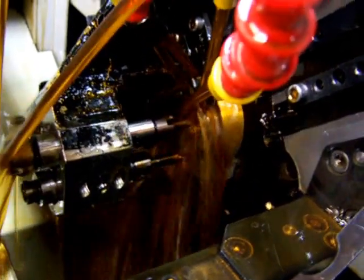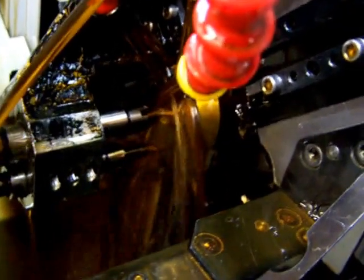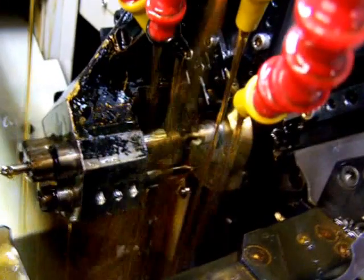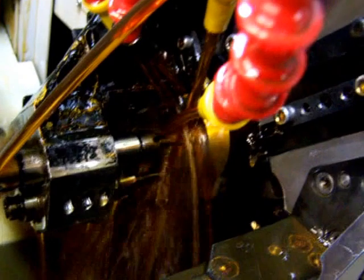Okay, next part I'm going to have to use the oil for. This is the counterboring tool that I've modified to make into a step drill. And this operation is a G83 command, which is a peck drilling command. Okay, so it's very important for drilling deep holes. And let's adjust the oil flow just a touch here. It's hard to see it now, but this is the thread forming command there. I think we maybe just caught the tail end of that.